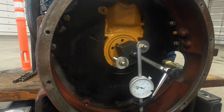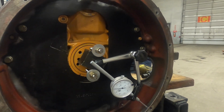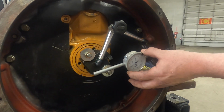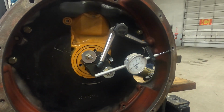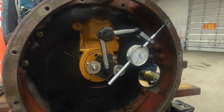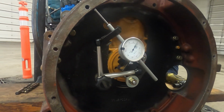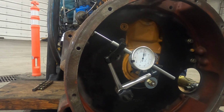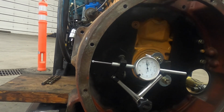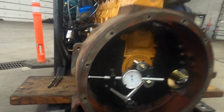Get back to that machinist on a lathe. That's just easier sometimes to think of it in quadrants. So you got a ways to go. This is not as finicky as what I was telling you at first as far as knocking it off, because we've got it bolted down now and it's a bigger indicator. Okay. So we got zero there, run it on around. Right there. Somewhere in there. We'll go back that way about 12 and a half-ish. Are you splitting the difference between your runout from side to side? Yes.